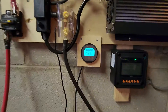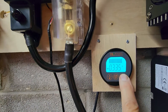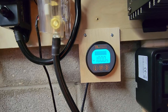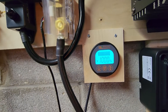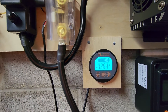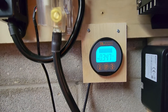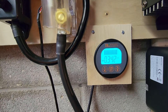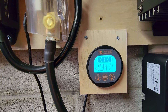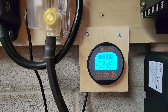Looking at my battery monitor — if you look at the battery percentage, I'm at 100%. It's been at 100% charge on my system the whole time. No alarms have gone off. If you look at amp-hours, you can see it's dropping slightly right now. If the batteries were not fully charged, this would be way up like a 20-amp charge rate or something like that. But the charge controllers have adjusted it down because the batteries are charged.